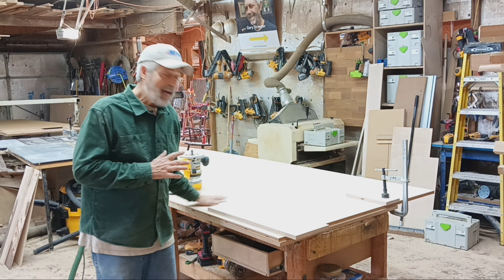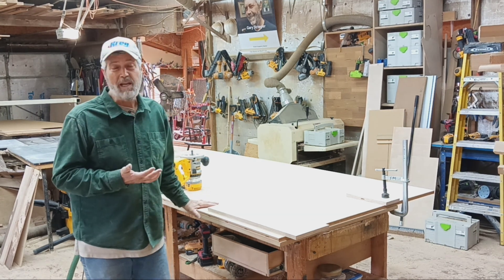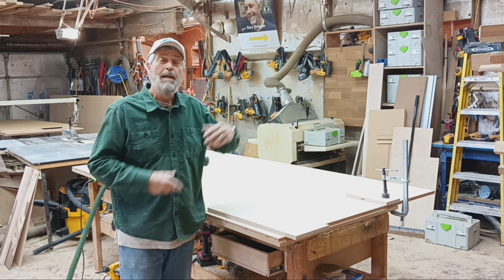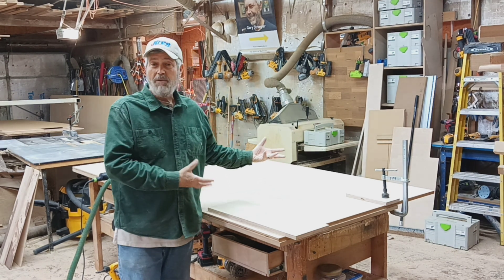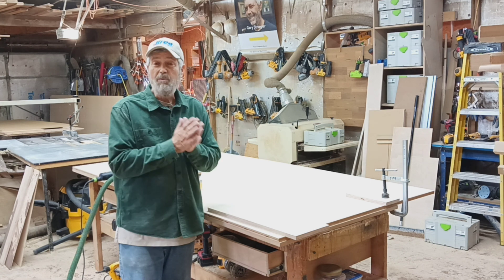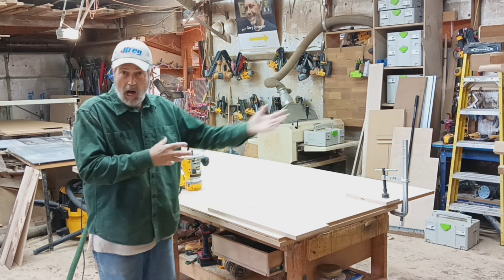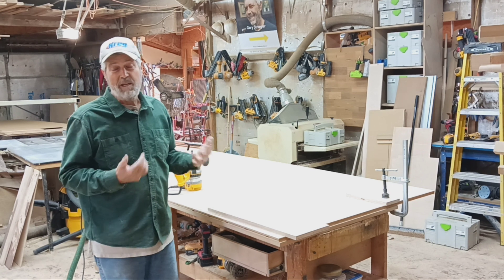The design on this is still going to be pretty simple. It'll be two pieces of plywood joined together and then glued to another two pieces of plywood to make a two-sided inch-and-a-half thick barn door, and I will alternate the joints so the joints won't be covering each other.